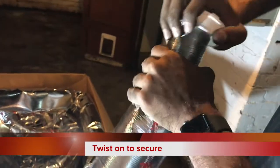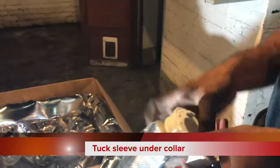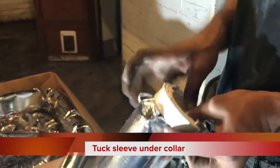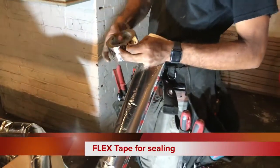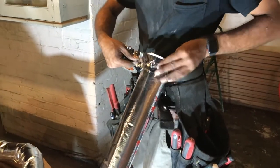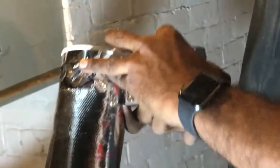Just coming with the kit, and there's your movement — it's just a twist on. Make sure you don't put things at the end of the trunk line. I have two runs that need to go there and I want to go out at 45 degrees so it looks smooth and not taut. I'm going to drill a two and one-eighth inch hole for the space pack using a bi-metal hole saw — works great on these projects.